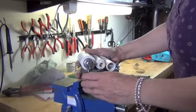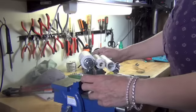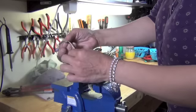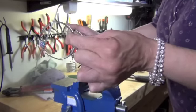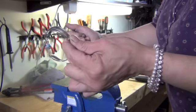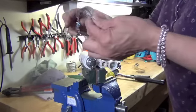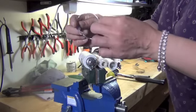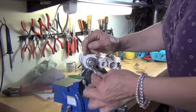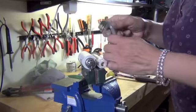It's really filled a need. Even though I'm not making a lot of stainless bracelets — I'm doing mostly silver plate — for example, this one here I finished recently. It gives just the perfect bend: a nice fluid motion, no kinks, a perfect bend for the wrist to fit the average size. If you're building something for a larger wrist, you might want to pull it out a little bit after you've made it — put it in your vise and pull it out. Using the different size rollers, you're going to get different kinds of bends.